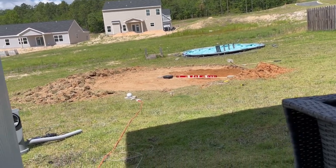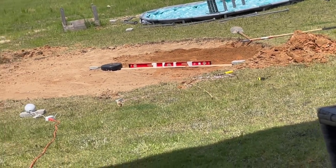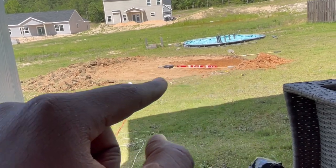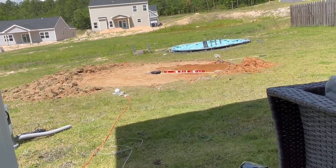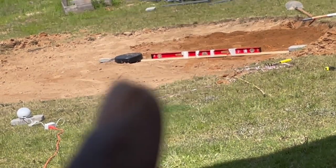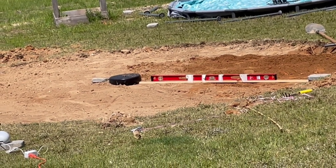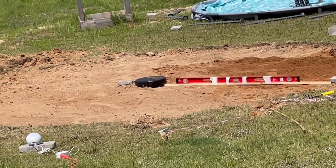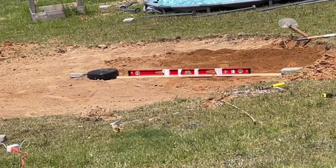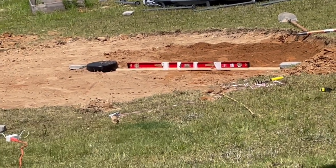Leveling is kind of more difficult. I started at the south end, the lowest end, and I'm working my way up. Yesterday I was moving around with just the pencil, but I decided to add a weight today — it's a 10 or 20 pound weight on top of the pencil through the hole in the one-by-eight. I also added counterweights — those brick pavers that go under the poles — one sitting on each side of the one-by-eight for equal weight distribution. I just make sure the bubble stays in the middle of the leveler as I go around moving and adding dirt.